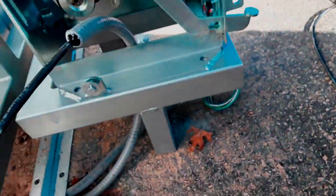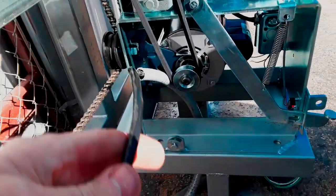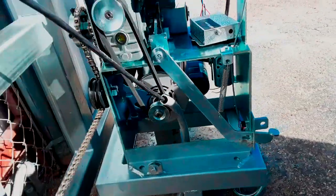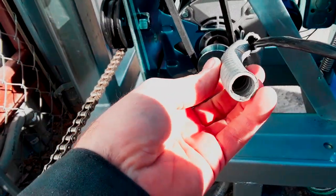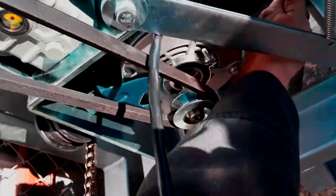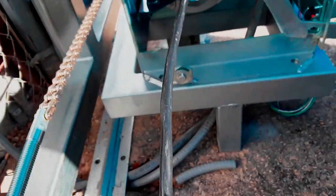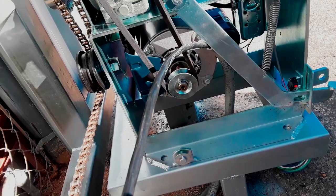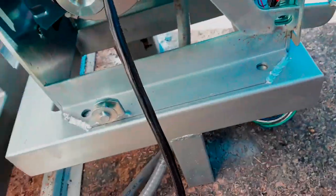I got ahead of myself - this one is just going to power. As long as we have it powered we're good; it doesn't need to send a signal. That's why I cut the conduit another six inches - this one is just going to go back over here and we'll zip-tie it so it's nice and secure. We'll strip it back a good six to eight inches, pull two wires, and connect it to the transformer we're going to plug in over there.